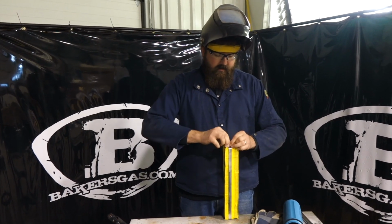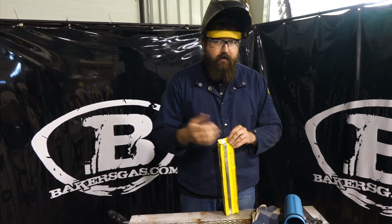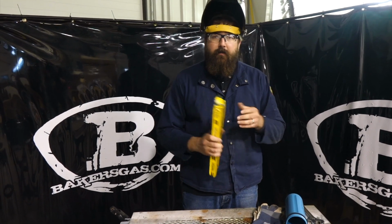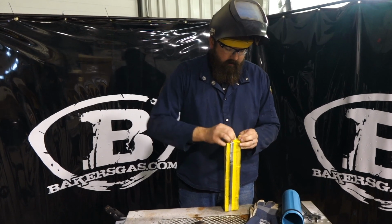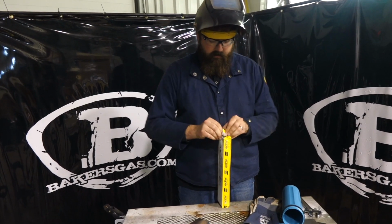It's perfect. So on a job site, what I'm thinking is if you're in power plants or in the industry somewhere, you could just carry 4 pounds of rod. You don't have to worry about pulling it out of the oven. It's already hermetically sealed. You don't have to worry about any of that. So you just crack it, the seal is broke here.